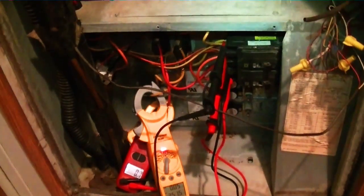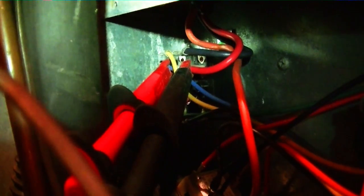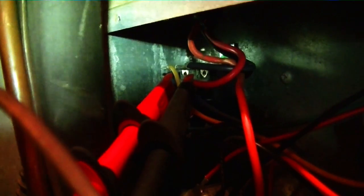I've set it so the blower will come on automatically in the ON position. Let's flip these breakers on again. I need to figure out what's going on with the blower. It's a little difficult to see back there, but we have a six-pin relay being used as a blower relay at the bottom. It has a green and common going as the low-voltage signal for fan. When it energizes the coil, it allows power to pass to the fan. During the off cycle when that coil is not energized, it allows a path for the heat strips to energize, sending power directly to the fan. Unfortunately, this relay is not switching back all the time — so the fan won't come on when the heat strips come on. We're going to take that blower relay out and change it.